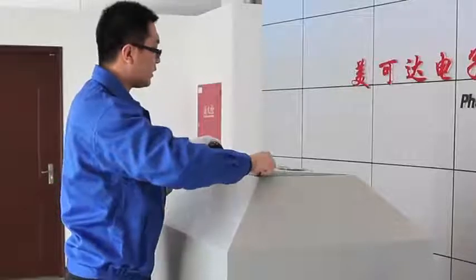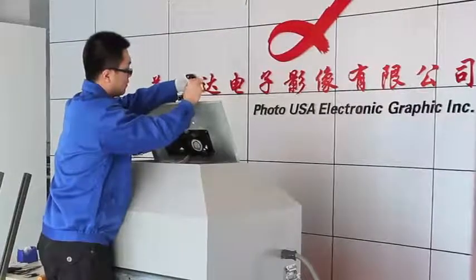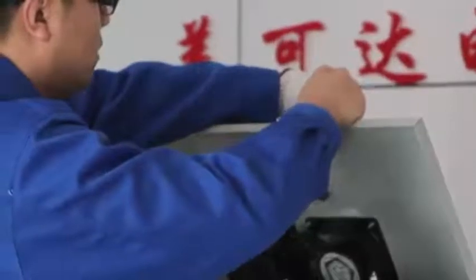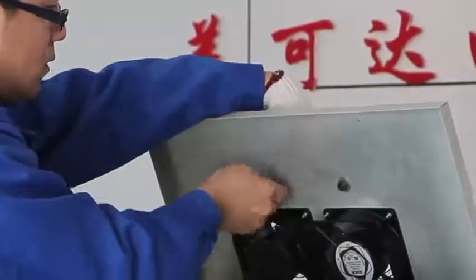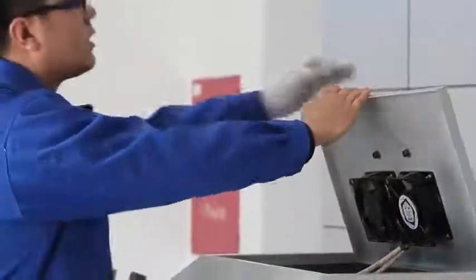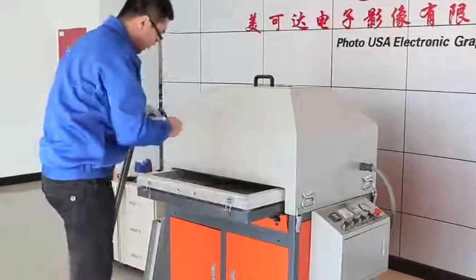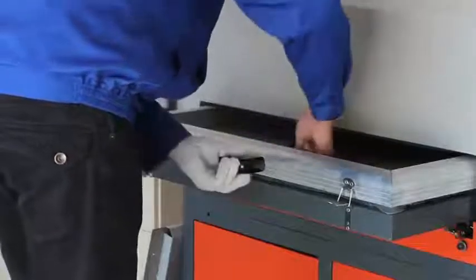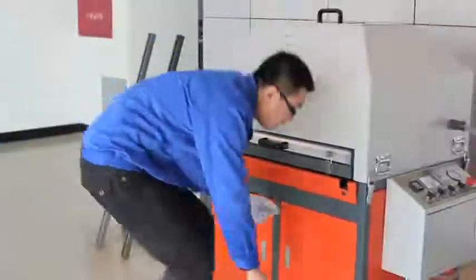The 3D vacuum press is very easy to assemble. The first step is to attach the support handles to the machine. Use the enclosed hex wrench to completely tighten the screws. Then install the handles for the workbench. This installation also requires the use of the enclosed hex wrench. Be careful not to puncture the plastic film while affixing the screws. After that, push the entire component back in and we can begin to install the support arms of the workbench.